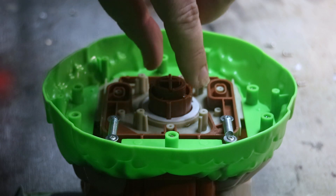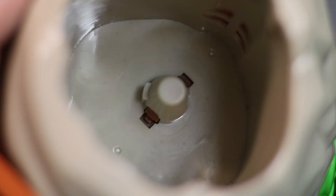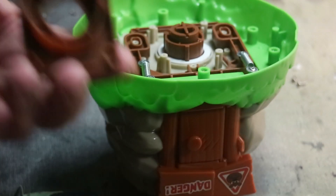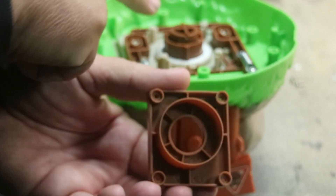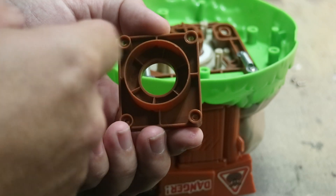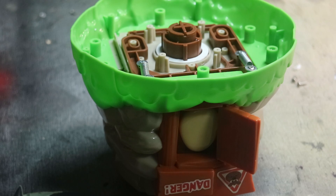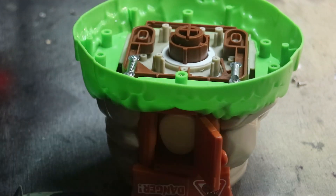Here in the workings of this device, there's a thing that gets pushed up and down which releases two little grippers inside. They grip into the bottom of the bear, which has a really strong spring giving it the motion to push out. It's semi-random — inside the ring there are little bits of plastic, and as a gear mechanism rotates, the gaps give it seven, eight, or nine presses before it pops. Kind of random, but not really good enough. You can feel it trying to push down as it rotates, and that feeling on the front button is a dead giveaway the bear's about to pop out.